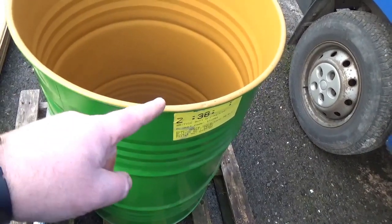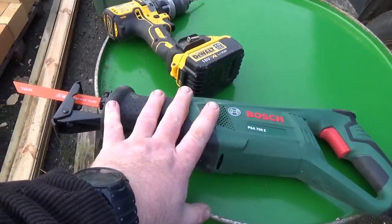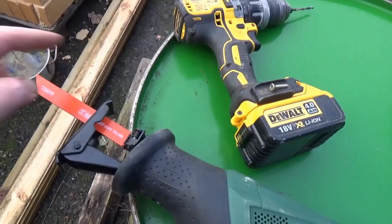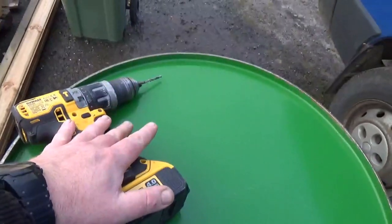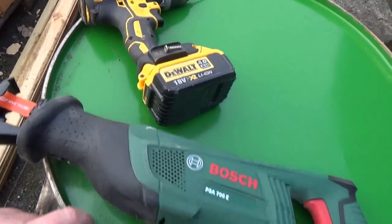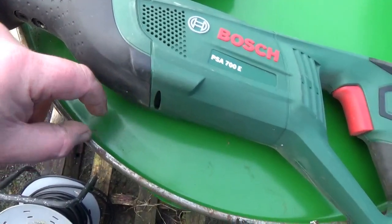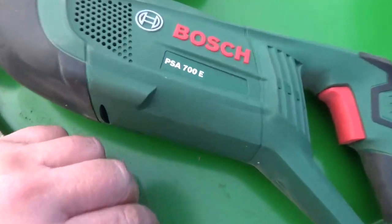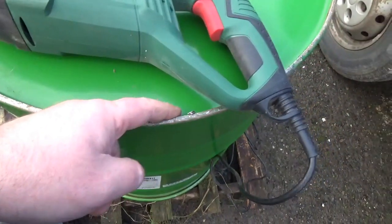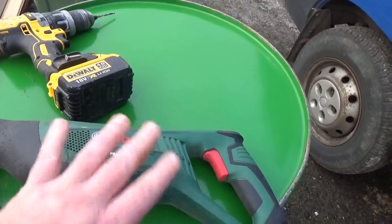First thing I'm going to do is flip this barrel over. To take the base out I'm going to use this saw with a metal blade on it. Getting straight through the steel won't work, so I'm going to use the drill and chain-drill a little slot just so I can get the blade in and then start cutting. I'll try to get it as close to the edge as possible. I was going to leave a little lip all the way around inside, but this is so strong I just don't need that reinforcement — so I'll cut it as close to the line as I can all the way around.